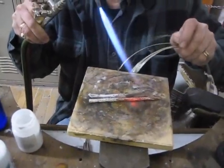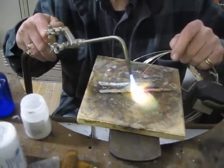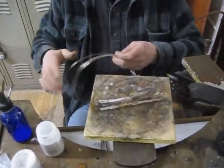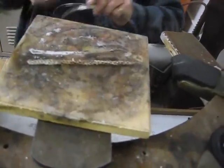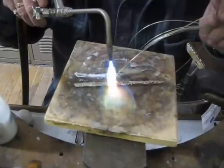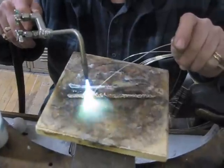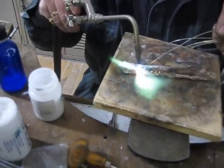I use a lot of solder. I need to unroll this a little bit better here. So far we've used just about a foot of solder. So now we're just adding piles of it here and there, and I'm going to go back and reflow it.